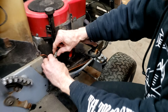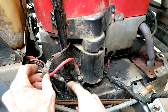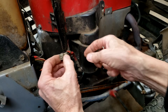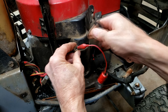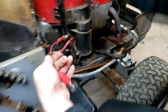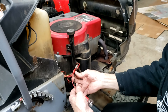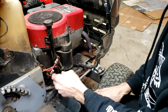I'll show you how to check the coil. The coil wires from the charging coil come out from the top of the engine. Don't confuse them with the other wires for the anti-backfire switch and the ignition kill switch. What you want to do is unplug this, take the side coming from the engine, and I'm going to use a trouble light. I'll fire up the engine and see if this light lights up — and you can see the coil is good because there is output.